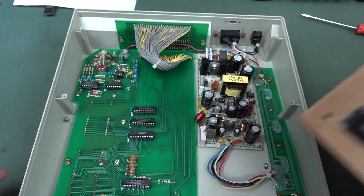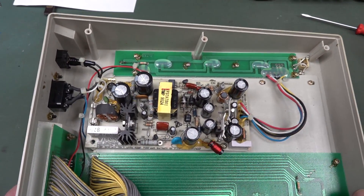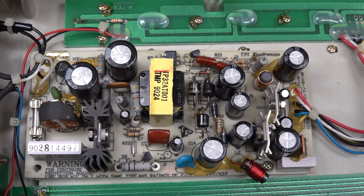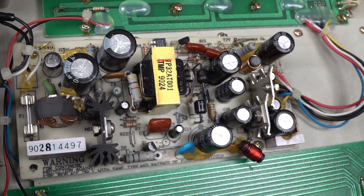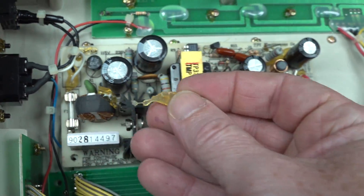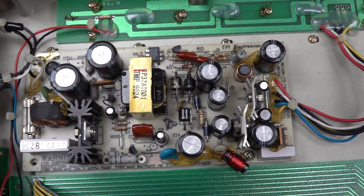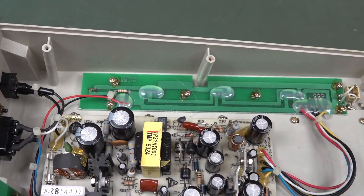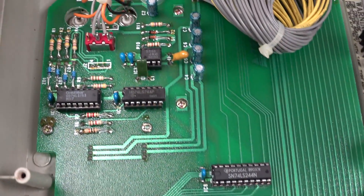Let's crack it open. Like Bakelite. There we go — got some extra buffers, called it. It's got a repurposed switch-mode power supply — TPI Electronics. Look at that: the resistor on top of the diode. The hot snot is a bit worse for wear. Not the world's greatest power supply. They've just bussed those between the boards using hot snot to hold the screws down. Once again some 244s on there just to buffer everything. And a Gold Star chip!